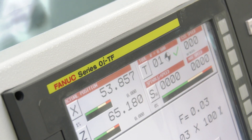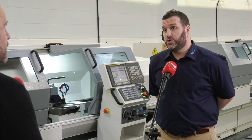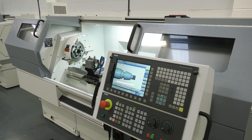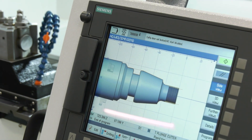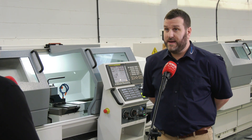And this particular one we see here has a FANUC control — what if you're not necessarily into FANUC and you wanted another option? We do a machine that looks exactly the same but it's called a Multi-Turn 2000, and that just offers you a Siemens control system for the people that are more familiar with Siemens. But with this FANUC you have the manual guide i, which allows you to be conventional in that respect as well.